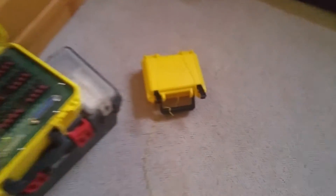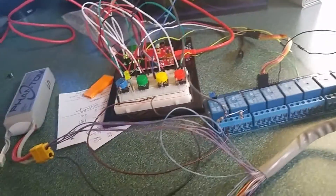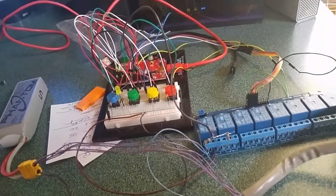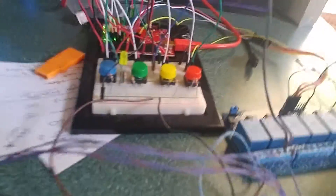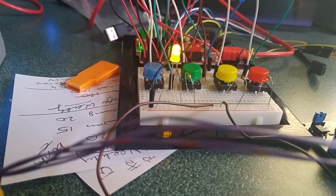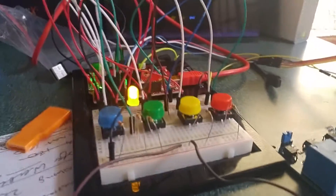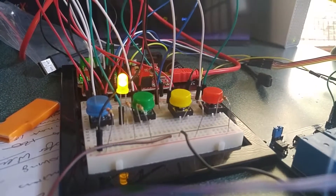So you see we have the e-match in the little box there, comes over to my digital P45, and we should have a little LED come on right there when I plug it in. Make sure you get some continuity there. There we go — I got it plugged in. The LED is showing there's continuity across the e-match.